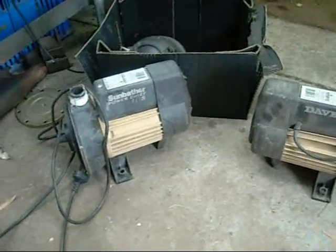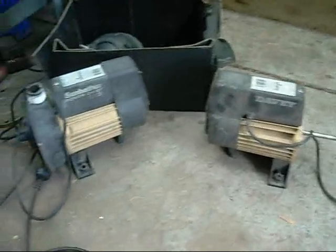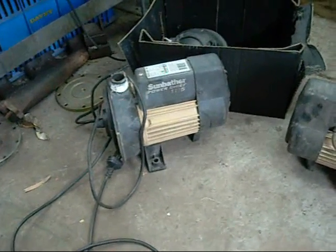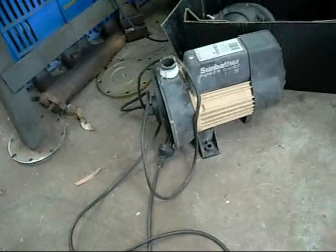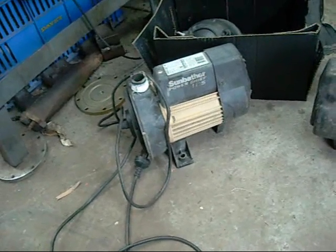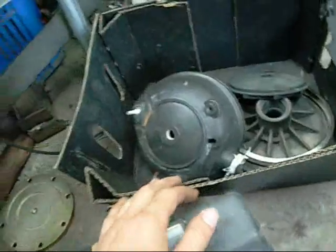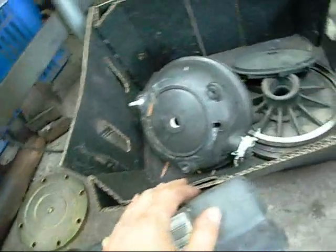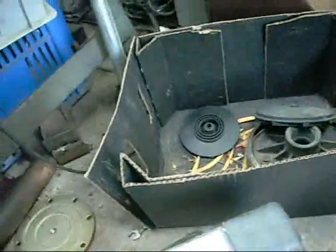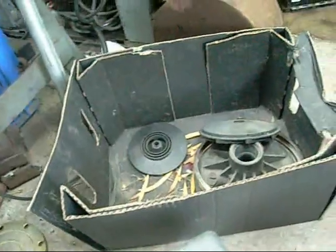G'day folks. Since Daikin decided to recall that mystery box unit I picked up, I'm going to be doing a video on pumps instead. Unfortunately I lost that unit — I got a phone call the following day that I had to return it because they decided they wanted it back. As I was packaging it up, I noticed the underside of the inverter housing was severely melted. Something horrible had happened to that condensing unit. I didn't quite find out what it was, but I know it's under the IGBT brick heat sink — so the IGBT overheated.